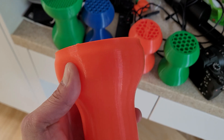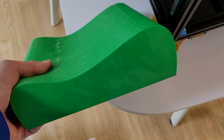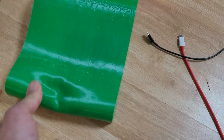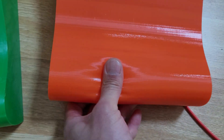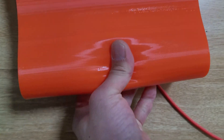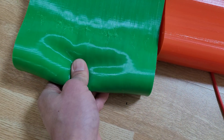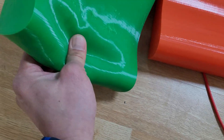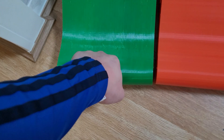If you want to achieve the same thing on TPU material — I'm trying to get that nice almost pillow-like form. I actually printed out a pillow, world's first 3D printed pillow, and this is with gyroid. Here's a good example: you can see the difference. Look at how smooth the gyroid is. Same amount of infill, but with hexagonal you can see the hexagon lines come through. With gyroid you don't feel any of that — you feel very equal pressure in all directions. This is probably the future of pillows. Look how it recovers like memory foam, whereas the honeycomb one is rigid and much stronger.